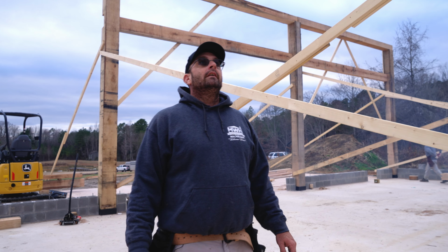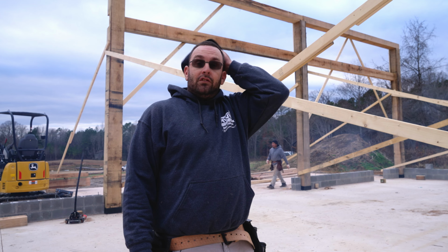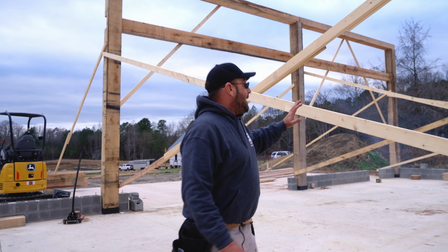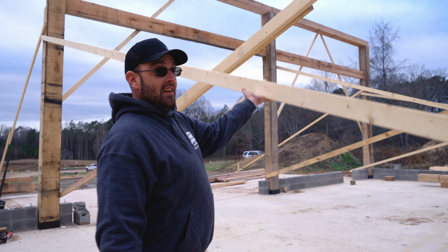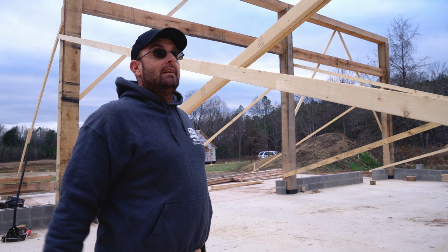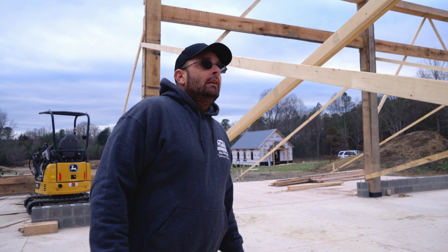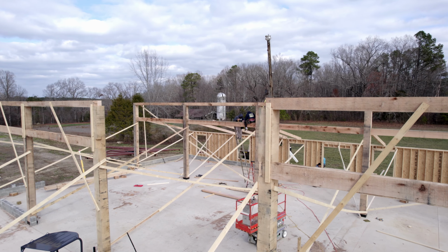This is all there is to it. But all in all, it's gonna be worth it. I can't wait till these tongue and groove decking boards go on the roof. It's really gonna shore this thing up. And then I won't have to be worried about 20,000 pounds just on these 2x4 braces. Just get really saggy right here in the middle. It doesn't make me feel comfortable until it's all locked in solidly. And we just won't be locked in until the roof decking is on. That delivers first thing in the morning. And we're gonna have a long day of 1x6 decking.